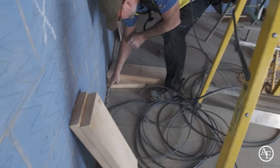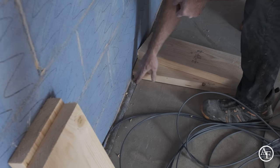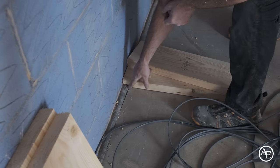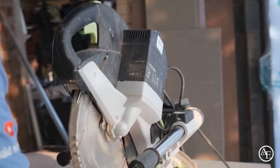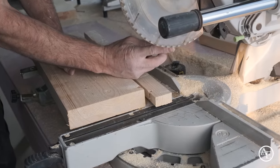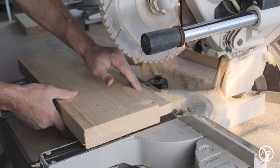The reason I've recessed, you see this? This is the thermal insulating board, and it's just slightly proud on this. So all I've done is just recess the top of it. Probably don't have to go so deep on the next one, but that's why I've done this. It allows me then to push up nice tight to the wall and keep it there. And the reason I'm putting the backstop on there, it means that this part of the blade, the fullest depth, will then get to this at the back, save me messing around trying to clean a load of it out.